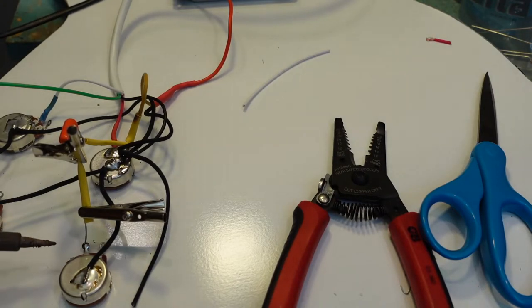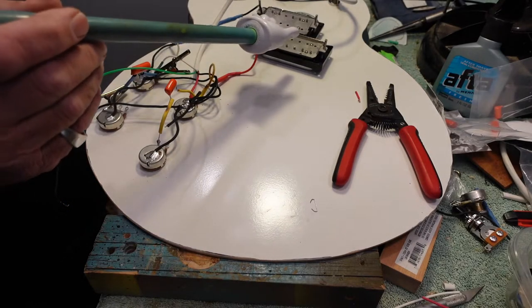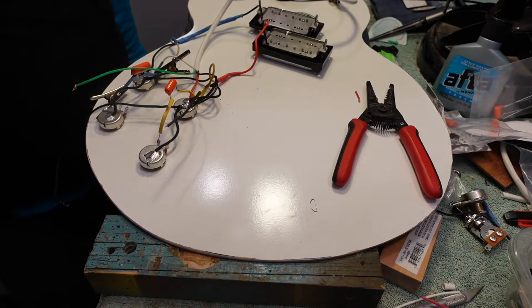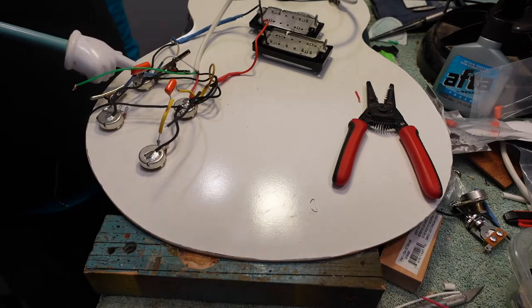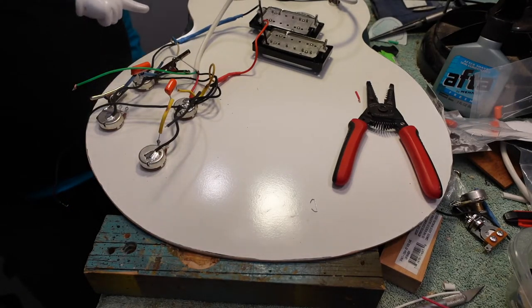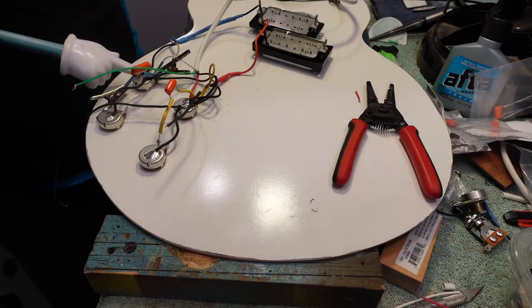And remember, the more counterclockwise lug on the pot over here, on all of them, in fact, have been bent over and grounded back into themselves. There's jumper wires of ground to everything. Okay, now we've got the second pickup, or the bridge pickup. I've got it color-coded blue, but it's the same thing. We're going to the most clockwise lug on the volume pot with the hot wire from the pickup. We have the ground wire already onto the back of the volume pot.